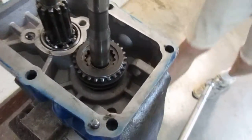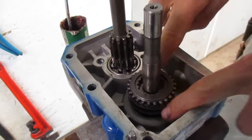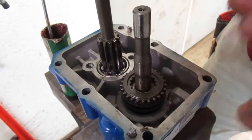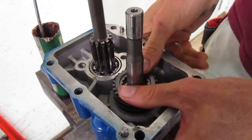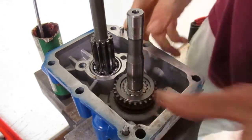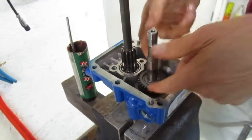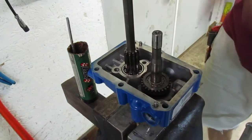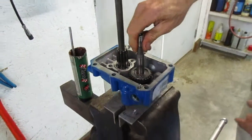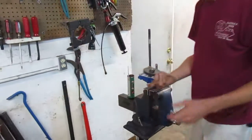Now we're in the first detent — you can see this is not flush, there's a little recess, but we're in the first detent which is actually the PTO engaged position. Push this down all the way and that's the PTO disengaged position. I'm not going to try to pull that back up by hand because if it pops up two clicks the balls come flying out and we'd have to do everything all over again. Now I'm going to take the PTO gear.